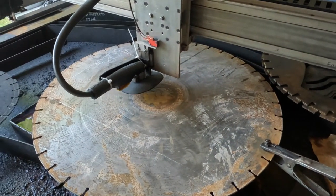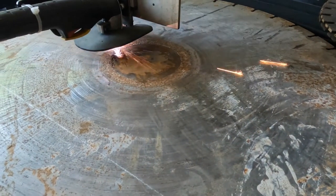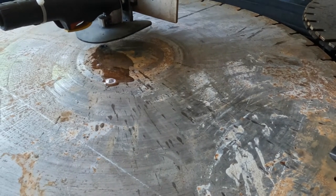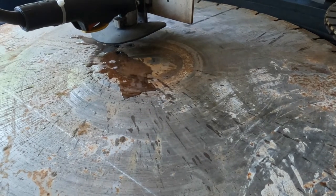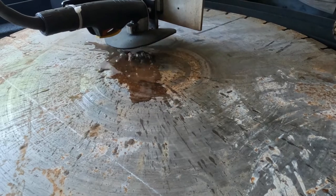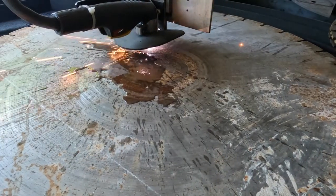Here it is on the machine. I'm using a recycled saw blade, about 0.175 inches thick — a little less than 3/16ths, might be 0.180; I haven't mic'd this one. I just know the cut speeds for it. The small detail parts I cut at around 30 to 40 inches per minute.